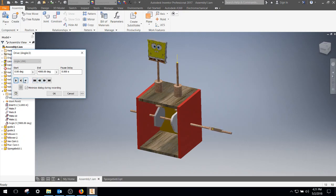The same sort of principle can be used to create your other topper. You can create stuff in the foreground or the background, etc. So once again, you find your image, you insert that image on a sketch, you trace it out with a spline interpolation, you extrude it, and then you share the sketch first of all to bring it back out. You do a decal, it'll put it on there, put a hole in it for your connection point with the top of the follower, and you're good to go. Thanks for watching.